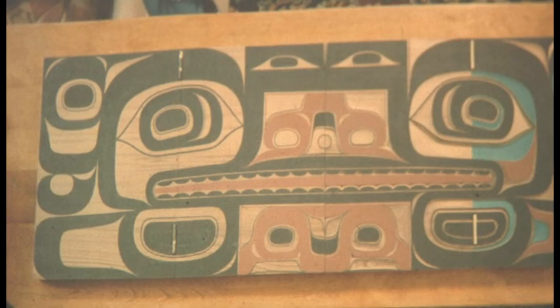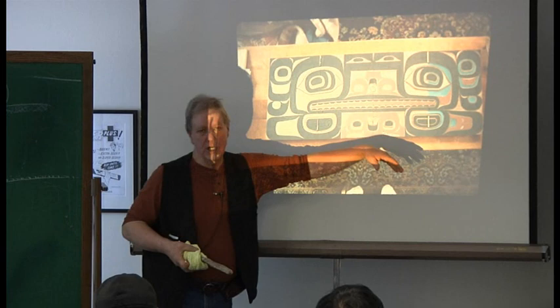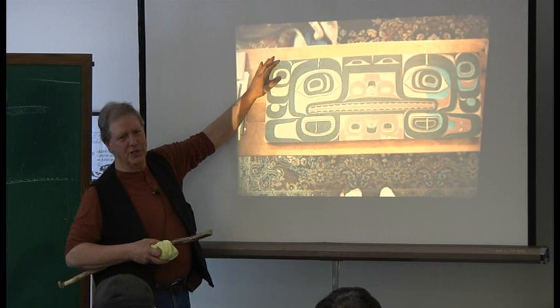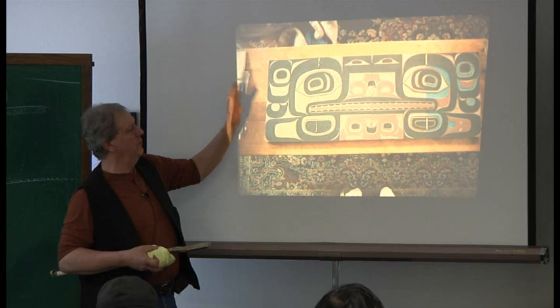And you can tell that's the case because it's actually not uncommon. It's not everywhere, but here and there you see it. You'll find a design, like a chest or something, and everything's carved, but you see that they forgot this one little crescent here. They forgot to carve it. And if it was carved first, they would never have overlooked it. But because it's painted first, it's really pretty easy to forget. I've done it myself. Years later, I notice, oh, geez, I forgot to carve that thing. And there are other indications that was the progression. Paint first and then carve.